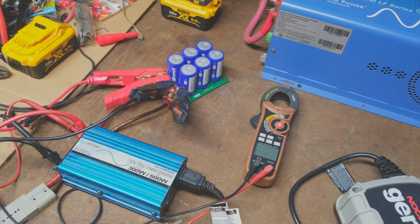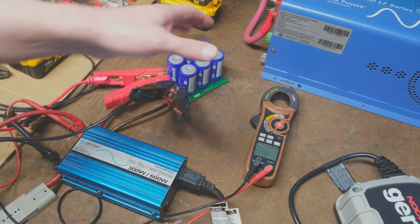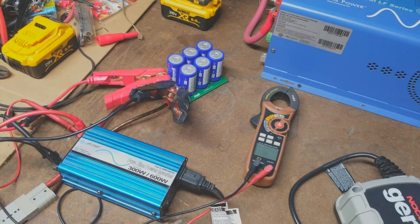You could use capacitors for battery storage, but you'd need many of them. Even a bank capable of two or three kilowatt-hours would require well over a thousand capacitors. Also, you can't use their full storage capacity — between 12 volts and 14.8 volts to be safe, you're only going to use maybe 20 to 40 percent of the available power. It's not as good as lithium technology; with lithium you can use 80 percent without affecting it, unlike lead acid at 40 to 50 percent.